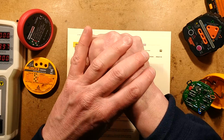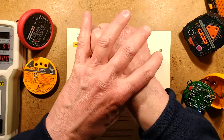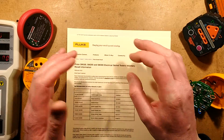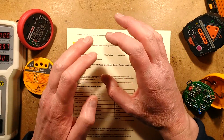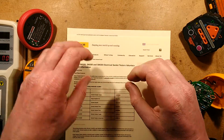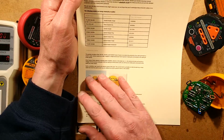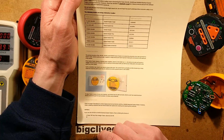Roundabout, I would say, in my case, for my size, because I've tested this, 4 milliamps, I can actually start feeling it going into the wrist area. And upwards from that, it increases quite rapidly. And I found that 6 milliamps was quite extreme, but it's considered that about 10 milliamps is the point that you're actually going to have involuntary muscle contraction, and that is possibly a bit of an issue here. So one of the things they say is, even a small shock is enough to give someone a surprise they could fall off a ladder.